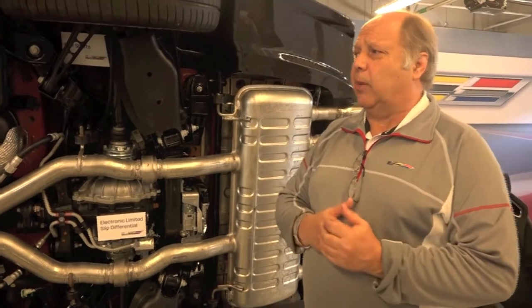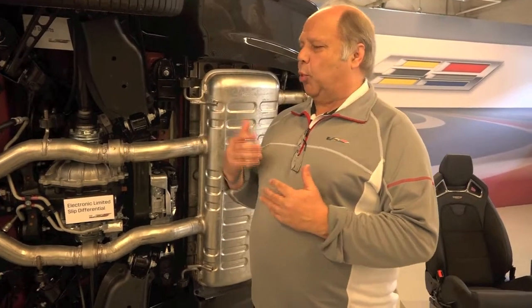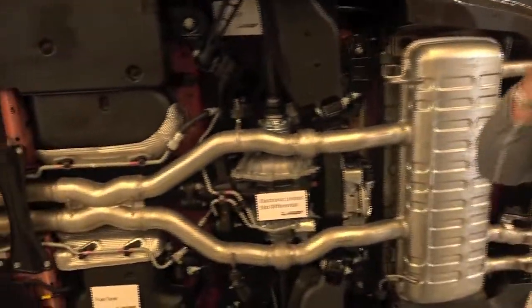Finally, I want to talk about the damping system. Now that we've made a suspension that can react loads, we have the third generation Magnetic Ride system. The third generation has a couple of significant features: first, it has a 40 percent increase in the amount of available maximum damping, so we can put a lot more damping in. In addition, the dual-coil design allows us to pull damping out faster, so when you go over a bump the wheel can get back down to the road faster — resulting in a much smoother ride while maintaining maximum control.